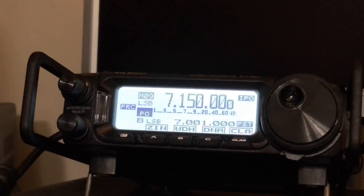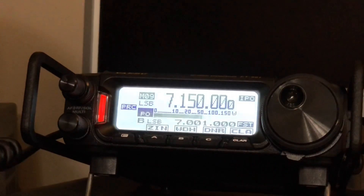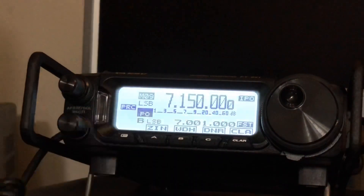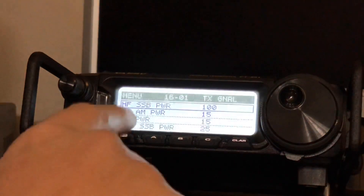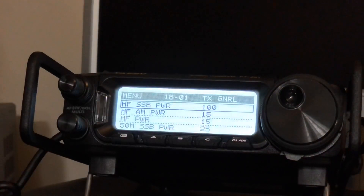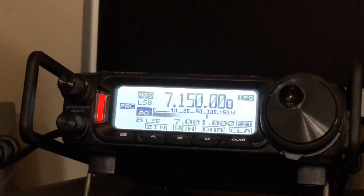Now I'm just going to single tap function to get out of there. Still set on power out, going into my dummy load. Now we're pushing right at a hundred watts. Now so if you're concerned that you're not getting any power out, put the metering on PO. Go into the big menu and make sure — if you're doing SSB — that it's set to 100 if you want to confirm you're getting a hundred. And similarly if you're on CW, make sure you move HF power to 100. I've got it minimized to 15 right now because I use this radio backpacking and running on a battery. So a single tap and I'm out. You want to see a solid red light and you want to see the meter jumping over to indicate that you are getting power out.